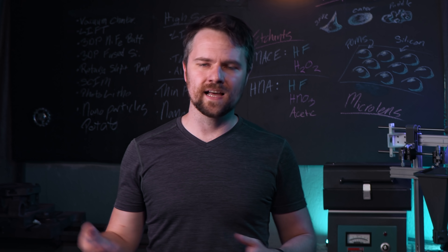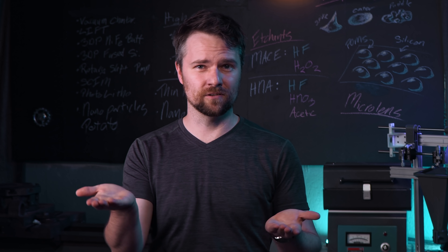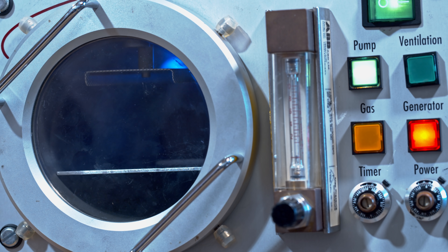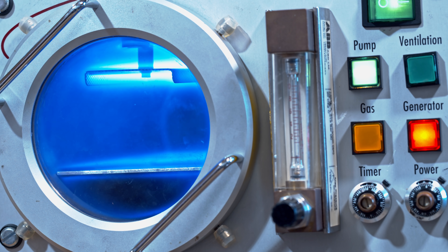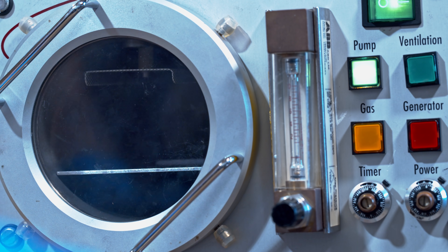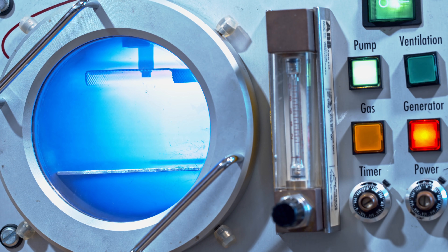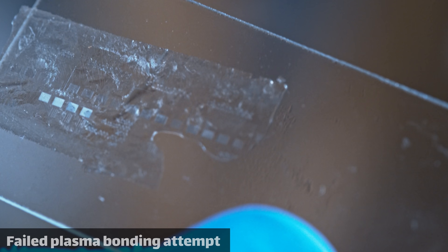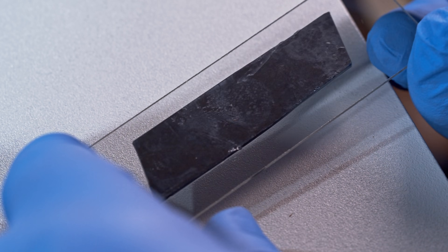From here it's a little tricky, because we need to take that very thin layer of PDMS and transfer it onto a glass slide since it's too thin to handle on its own. The classic academic way is to plasma bond it to the glass — put the glass slide and the PDMS-cured microlens in a plasma chamber, expose to oxygen or air plasma for a couple minutes, making both surfaces reactive, then squish them together and they bond pretty much permanently. I tried that but couldn't quite get it to work — the edges of the wafer build up a little extra PDMS during spin coating, so only the edges actually bond. Instead, I just stuck the glass slide on top of the uncured PDMS, degassed them together, cured it all as one unit, and then peeled them off. That worked great.